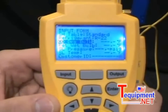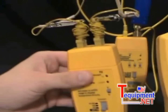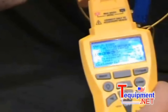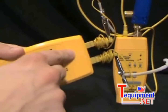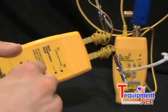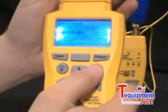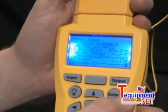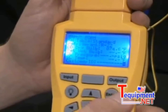The next thing I have to do is get my outdoor dry bulb. It comes with the ATH4 dual temperature head, and I have my dry bulb thermocouple plugged in on T1 of the dual temperature head. I'm going to select T1 on the dial and press Enter on the HVAC Guide. It's 74 degrees in this room right now, and I'm going to press Enter to lock that in.